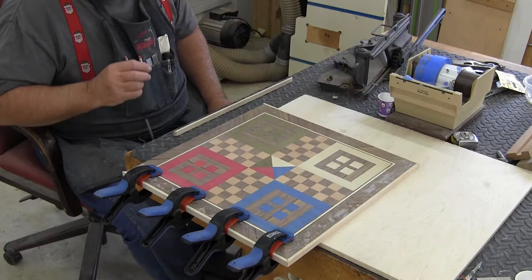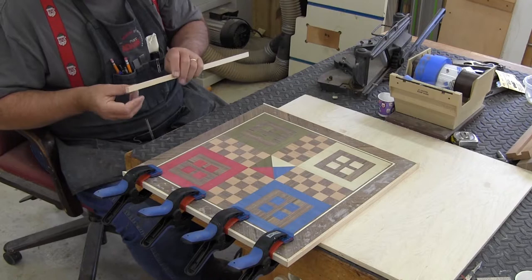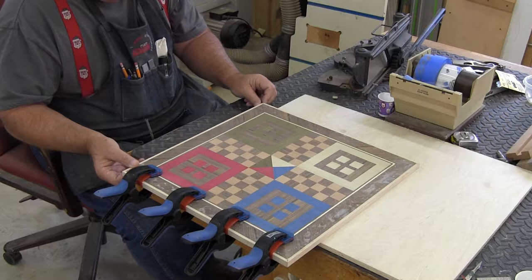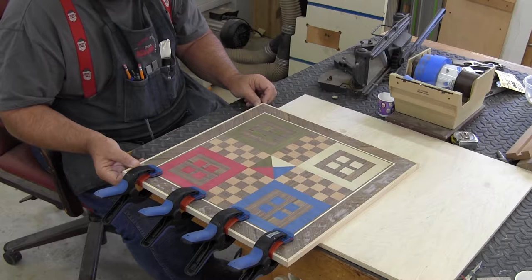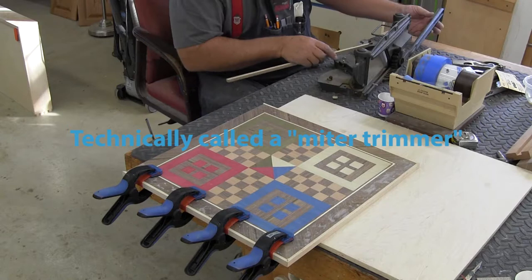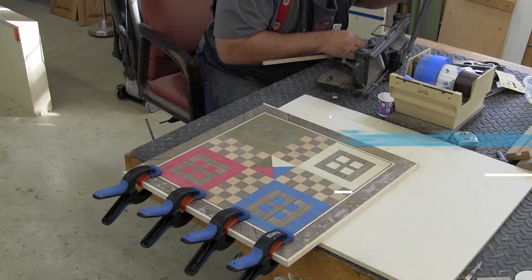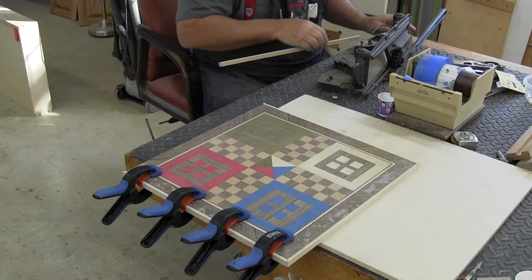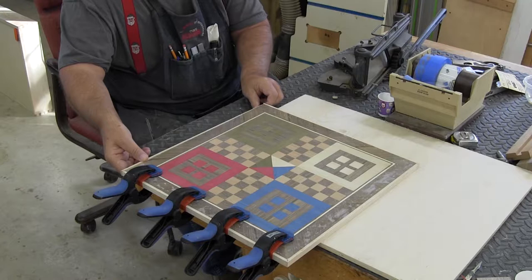So I've edged three sides and I'm on my fourth — my last side — and this is a trim and fit kind of thing. I've got just a whisker more I have to remove from this. The number one rule in woodworking is you can always cut it shorter — I can't cut it longer — so I'm very careful to sneak up on this so it fits perfectly. I have here a guillotine, a very handy tool for doing these really fussy miters. I can set the piece against the blade and advance it in just the tiniest amount. It cuts off the shaving and I can sneak up on this thing about a thousandth of an inch at a time.